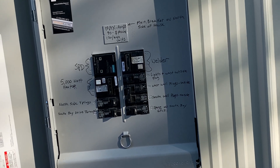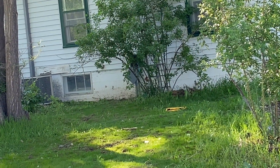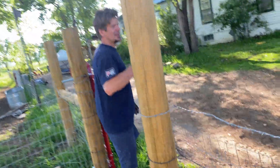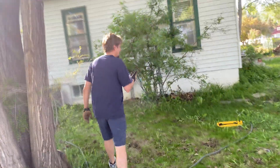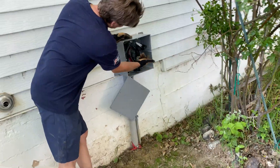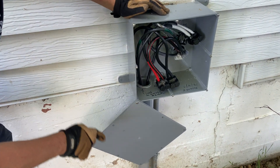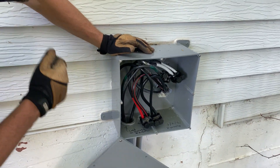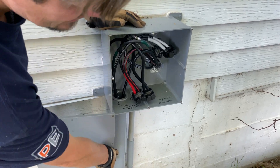There's really not much more he's going to need. We did upsize - for our wire, it is sized two sizes higher as it goes through the house especially, because you have to pay attention that it's a welder and a heater, and I bet both of those are going to run in wintertime. The heater is 5KW so it only pulls about 20 amps. This is our connection that went through the house with Polaris connectors to connect from the ground. We did go 30 inches deep, somewhere in that vicinity, and it is in conduit the whole way - 2-inch PVC schedule 40 and 80. It does have its expansion couplings as well.